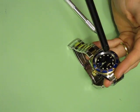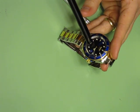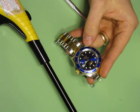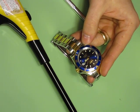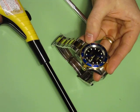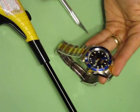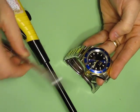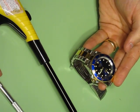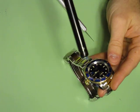What we're going to do is apply the heat directly to the cyclops until a white puff appears kind of under it — that indicates it's ready to come off. On various watches I've done this takes anywhere from two to ten seconds. Watch for that little puff under the cyclops, then use the razor blade to slide under it and pop it right off. Be careful because it's really hot.